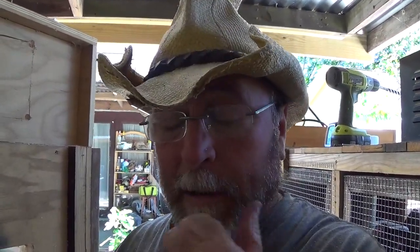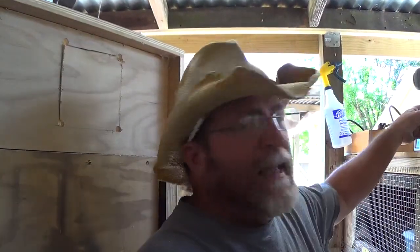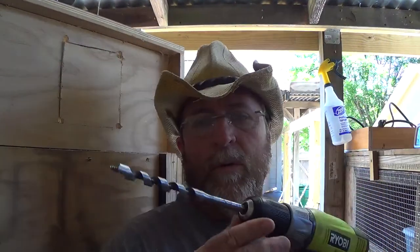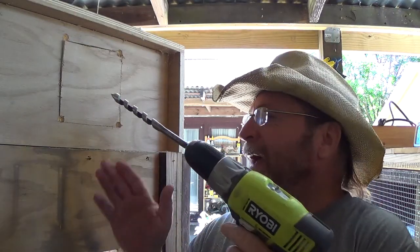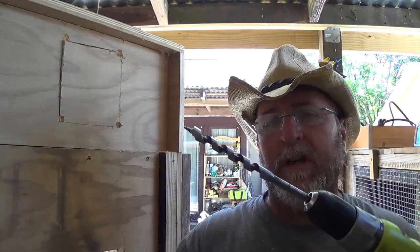Okay, you guys. So I'm going to video that, let you see what I'm doing with that. I'll take you along with me. Okay. All right, guys. I looked over, and I forgot to turn the camera on. Okay, so what I did, I cut a hole out here. I'm cutting one out here now. The way I did it was I laid it out and I drilled holes on all 4 corners, and then I'm going in with my jigsaw to cut it out.